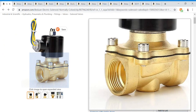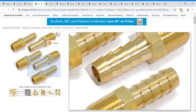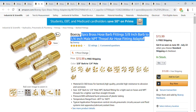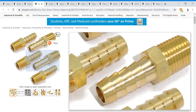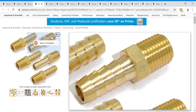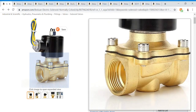The next is four of these adapters. These basically are going to screw into the solenoid valve. Then you're going to need five of these hose barb fittings — barb quarter-inch male NPT fittings. I'm going to be using all five of these in total within the project. These screw into this, and they're going to be on each side.